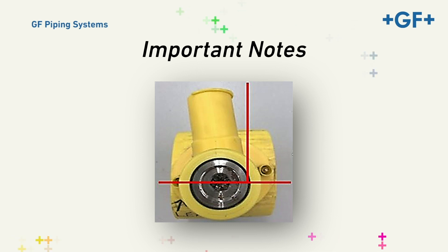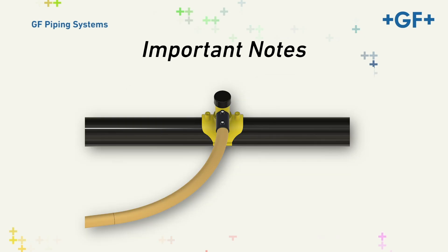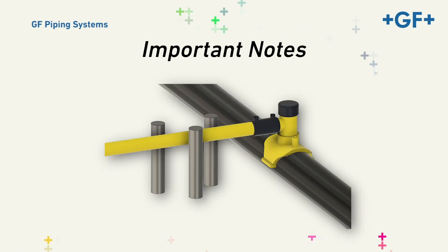However, we realize this may not be possible in some cases. Considering the fact that most two-inch service mains are coiled pipe, the clamping devices used to install high volume tapping tees are not designed to overcome these forces. The operator must follow the recommended torque remediation procedures as shown in this diagram. Note that the diagram makes use of stakes on either side of the service main.